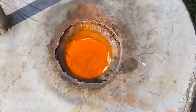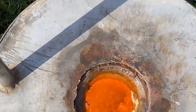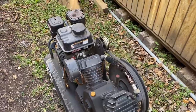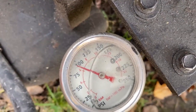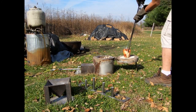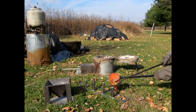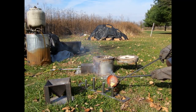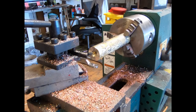This thing is screaming — it sounds like a rocket. It really is way past the jet engine phase with this kind of power drinking through it. I revved up the engine a little bit — it died on me the other day, and I wasn't letting that happen today. So I revved this thing up to about 85% power, and here we are seven minutes later with the crucible full of molten brass.